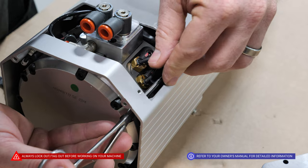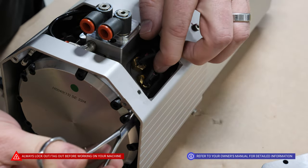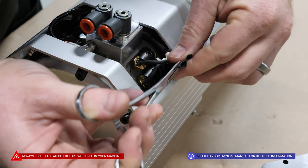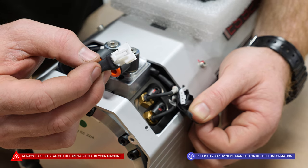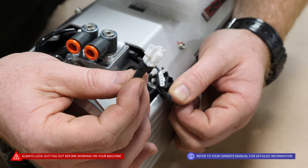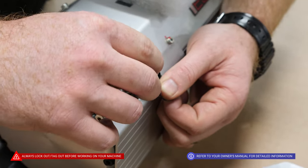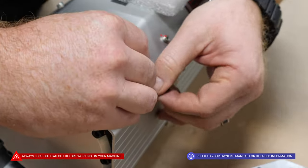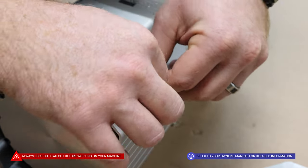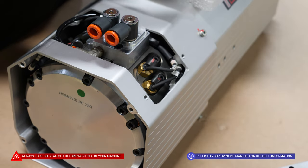It's kind of tricky to get — it's buried in there pretty good. If you're replacing an old motor, this will have to be removed from the old motor and used on the new motor. This is the fan override connection that needs to be clipped in. It has a release clip, and these are directional, so they can only go on one way — it'll clip on. Make sure the retaining clip locks into place. Then this can go back inside out of harm's way. We can put the cover plate back on.